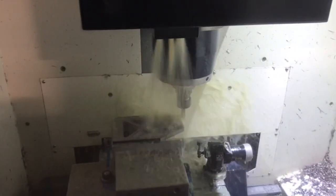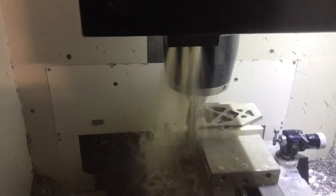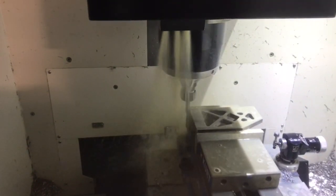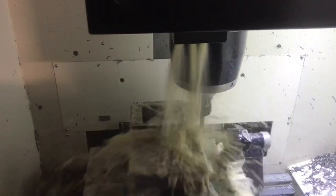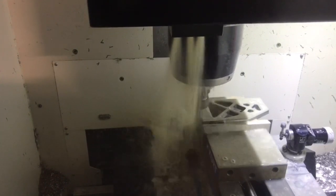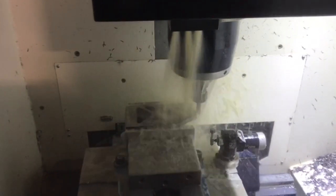I decided to make something a little bit nicer in this situation. So I took and programmed it on our Mazak mill using Mazatrol, created the geometry necessary, drew that up and came up with something that's going to be a pretty attractive part but still functional. I do have further plans for this piece — I plan to bush it so that we can do different sizes, giving you the ability to interchange the bushing to change the size for your threaded rod. I also ground it a little bit to flatten it out and give it a better surface finish. Overall I'm pretty pleased with how this piece turned out. I'm speeding the video up to get us through the process a little bit quicker.